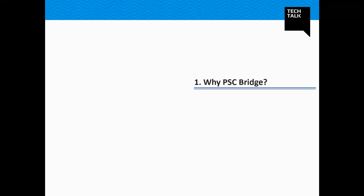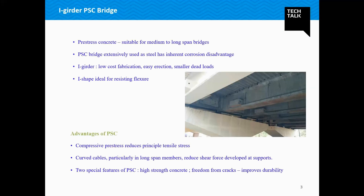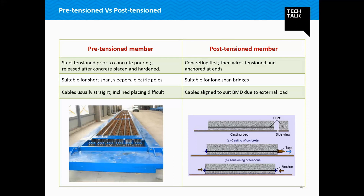The first question which arises is: why go for pre-stressed bridges? PSC I-girder bridges are suitable for medium to long spans. Pre-stressing reduces the tensile stress in the girders and provides freedom from cracks. Moreover, it is a good substitute for steel girders, which have an inherent corrosion disadvantage in aggressive environments. We can have both pre-tensioned and post-tensioned PSC members. In pre-tensioned, steel is tensioned prior to the pouring of concrete, while in post-tensioned, concreting is carried out first and then the tendons are placed. In post-tensioned, placing inclined cables is easy and they can be aligned to suit the bending moment diagram due to external load.